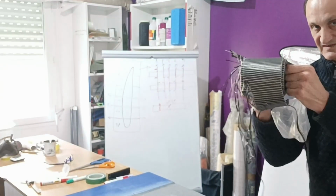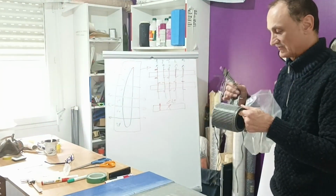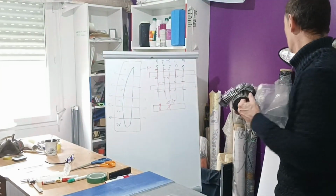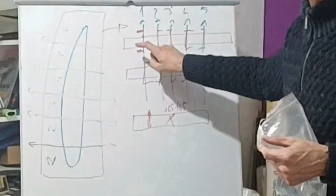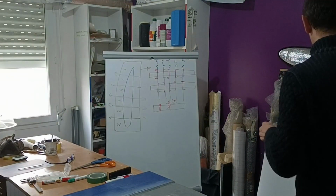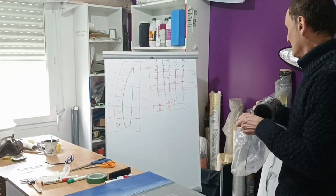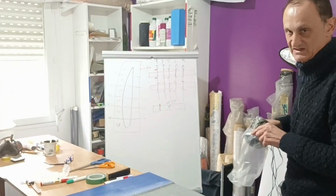First, it's only 10 centimeters, so I will have to make a lot of work. And secondly, it will not wrap around the corner, because it's a 90 degrees corner. So it will not work, it will be a pain to do the job. So I will use the 300 plus minus 45. So that's the solution I have found to reinforce the mold directly.